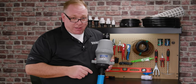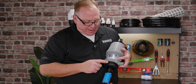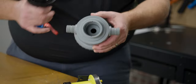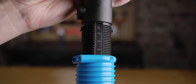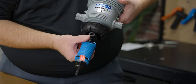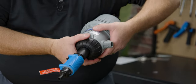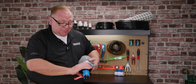Sometimes people get excited, say they want to see the ratio and not the percentage, go ahead and mount it and plumb it together — and unfortunately didn't pay attention to the arrow. To resolve this, the lower cap nut can be loosened until it comes off. It takes a little strength because there are lubricated O-rings creating a very tight seal. There are four recesses on the internal and four tabs on the chemical cylinder. Review which side shows percentage or ratio, make your decision, clock it a quarter turn so you can see your preferred scale with the unit fully seated, and then re-tighten the lower cap nut with firm but not extreme pressure — the O-ring gasket is your seal, just make sure it's snug.